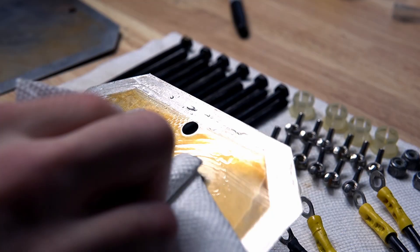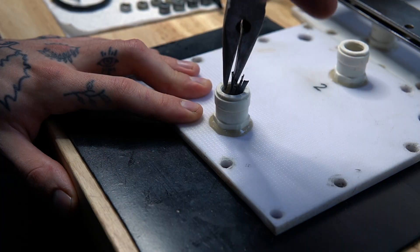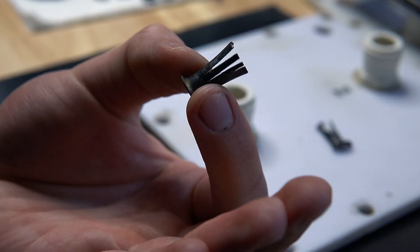Honestly, I was expecting a lot more wear and corrosion on the plates, but there was really only a thin layer of grime on the surface. Well, that and the brass tube inserts that I used to fix some leak issues are basically completely dissolved. Initially when I was building this thing, I really didn't think our potassium hydroxide solution would be strong enough to basically completely dissolve the brass, but it was. So I suppose some lessons are learned the hard way.